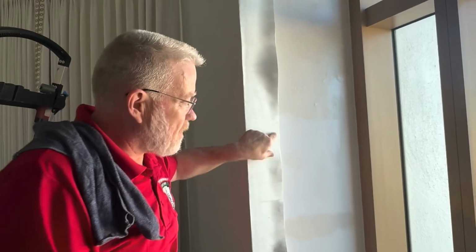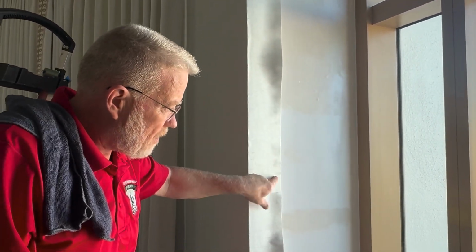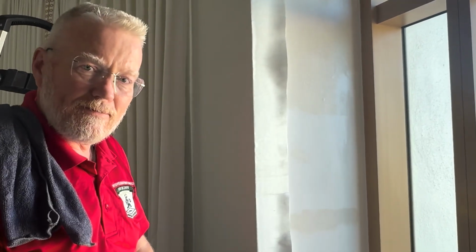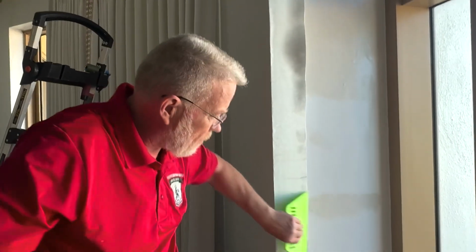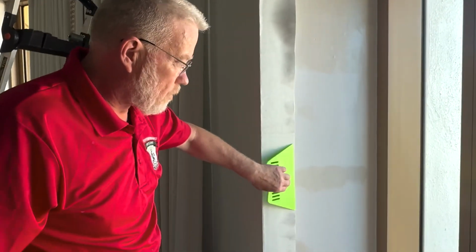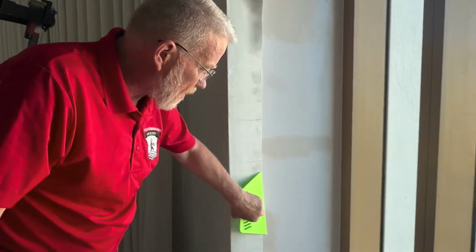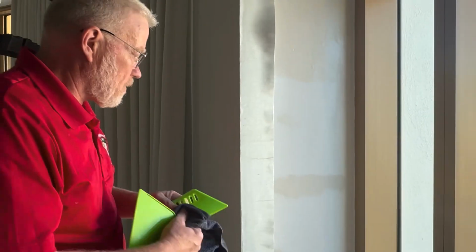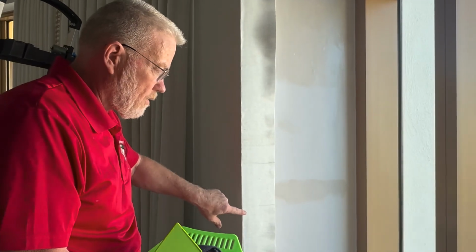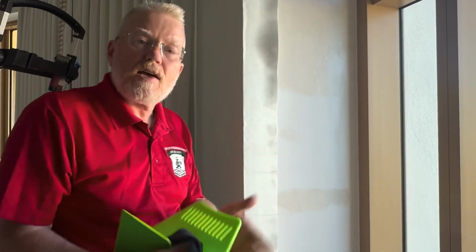The result is that you must now plumb this by putting a laser line on this and cutting it straight. Because it's not going to be straight, because I already know my angle isn't straight, and therefore the edge, which is a factory edge, is not going to be straight because the angle is pulling it a little here, pushing it out a little there as it changes.